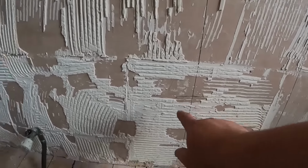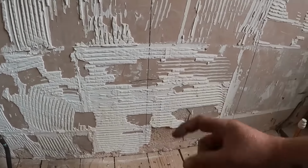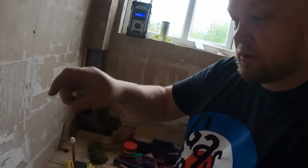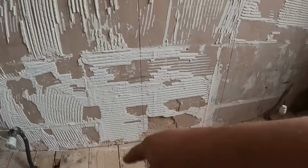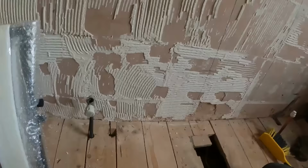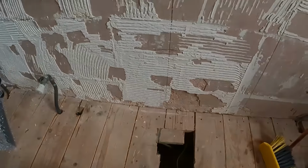Depending on how big the holes are, because it's a black towel rail, I'll have to get some talon shrouds and little talon black clips that go over the pipes in black, just to cover that up. So let's get this marked out, chop this bit of the wall out, and then we can get the floor up, get the heating drained. I'll probably, as always, bung a tank because it is a gravity fed system, and then we can get these two pipes into position here.